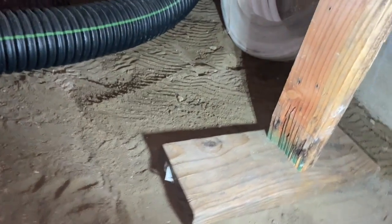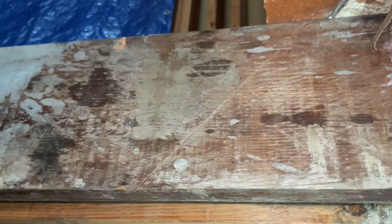The next step is to actually make the cut. I'm going to use a speed square to get a straight line going down the floor joist on either side, and we got the floor joist cut on either side.